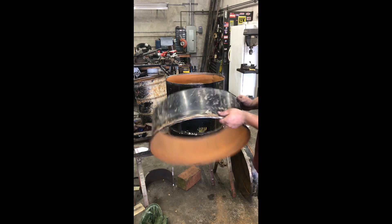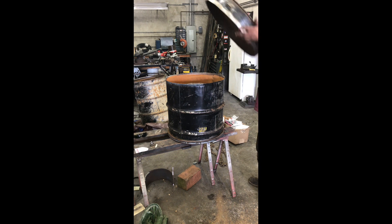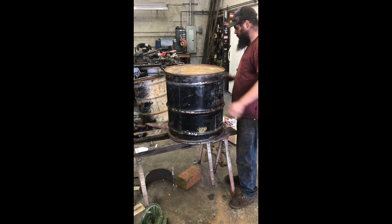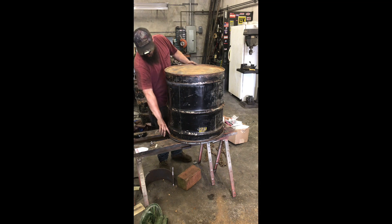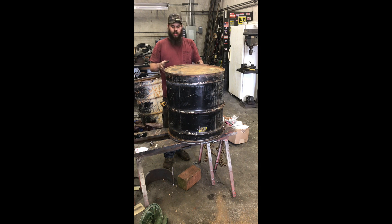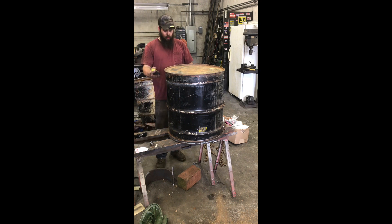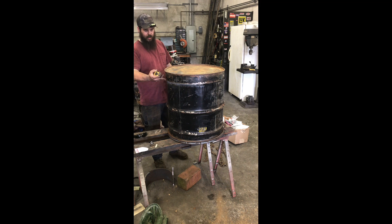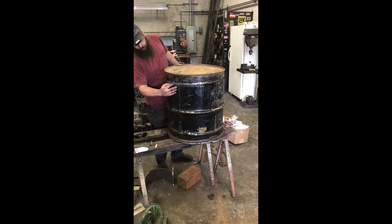There — I got our eight-inch rip taken out of the barrel. Dressed up the inside right here, got it sitting up on the sawhorses at a nice easy working height. Here's the bottom that we took the eight inches off of, got it cleaned up. It should drop right in. A 55-gallon drum from bottom edge to the underside of the lip is 33 inches, so we took eight inches out — our drum should total out to be 25 inches tall. I'll get this set to 25, put a tack on it, come over to the other side, repeat, make sure I'm square all the way around. Since we ripped it right on the edge of that bevel where the rip rises up, we've got a lip right here that we can fill in with our weld.